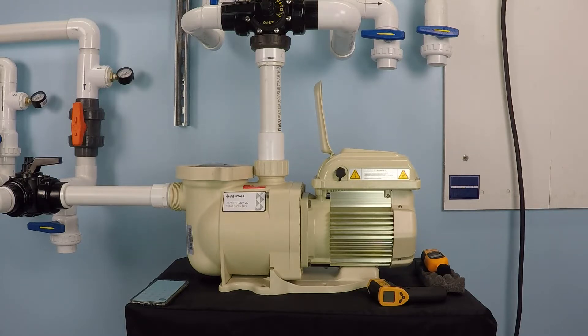I've set up a display here so I can show you directly what this means and how it works. The first thing you need to realize is that power consumption is important, but when figuring all of this out, something you need to be acutely aware of is flow rates. The amount of flow you get through your filtration system dictates how long you need to run your pump for.